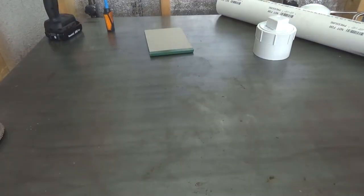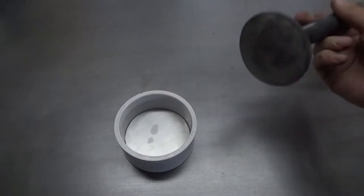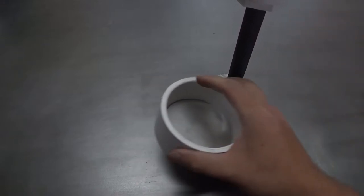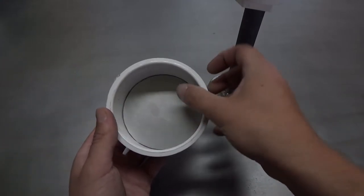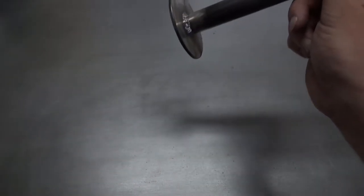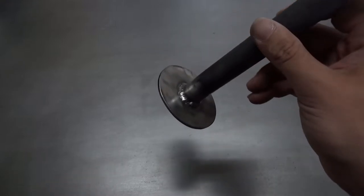It's later now, the table's nice and clean. I've got the squishy platen attached to the rest of the piston and got that little reinforcement plate fit in the bottom cap — it looks like the moon. Welding is obviously overkill; you could get away with just using some JB Weld or epoxy. Also, if you're going to weld it, try not to TIG weld something that used to be galvanized because you'll get all sorts of little pinholes. Still did the thing — don't pay any attention to those.